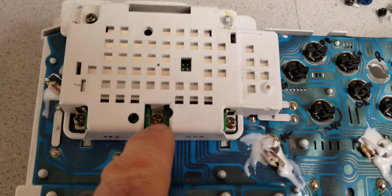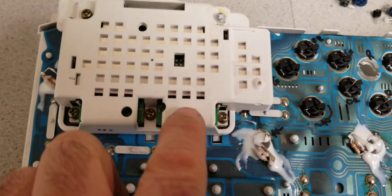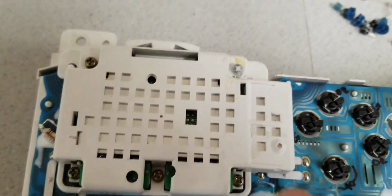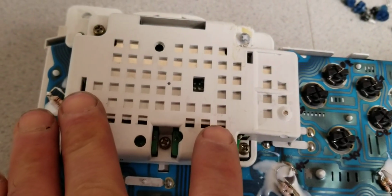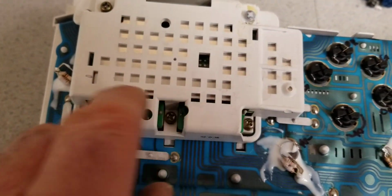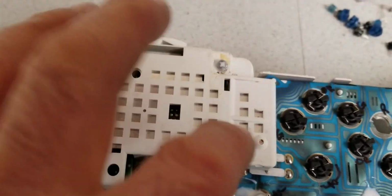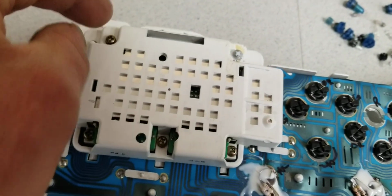I suggest you start with this screw. There are a bunch of contacts here underneath, and before you install it, you check the two connectors here and align them. Once it's properly set, I suggest going with the middle screw, so it's all aligned pressure-wise, and then one screw, then tighten this one, and you can go cross if you like. So you know what I mean.